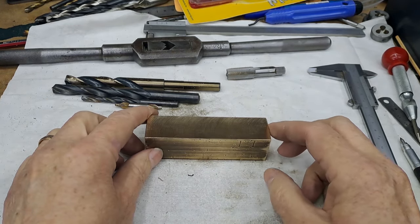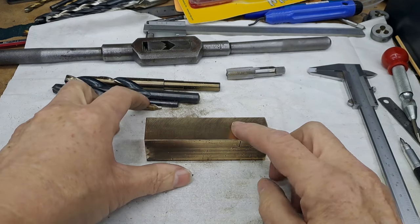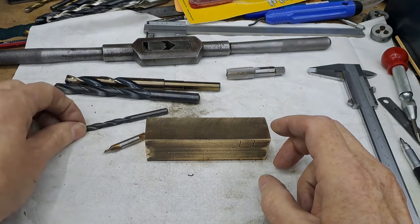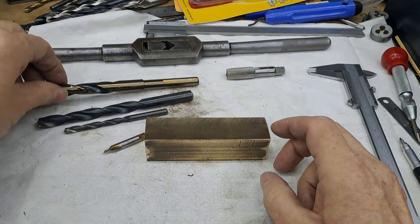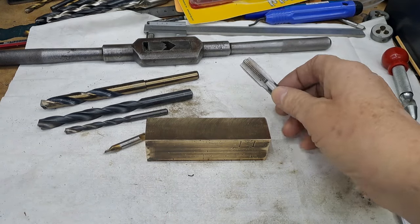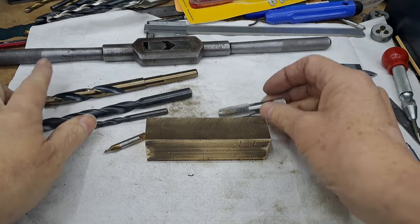And we're going to come to the middle here, so 12.7. We're then going to come down 21 and put in a center drill, go all the way through with a 6mm, then a 10mm, then a 12mm, which is the closest I've got to the tapping size for quarter BSP, which should be 11.8, so 0.2 of a millimeter bigger. It's not going to make any difference.